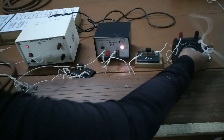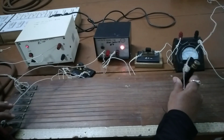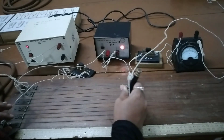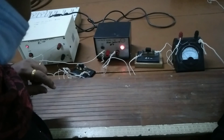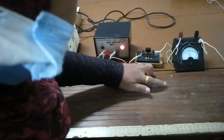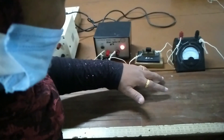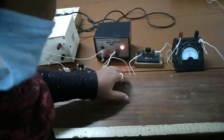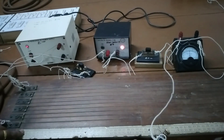To find L naught, we want the galvanometer pointer to coincide exactly with zero. Press the wire using the jockey and drag it along until the galvanometer reads zero. Now count the wires: 100, 200, 300, 400, 500 — five wires are completed. The balancing point lies somewhere on the sixth wire, so you read from the scale on that wire. Since it is the sixth wire, use the downscale.